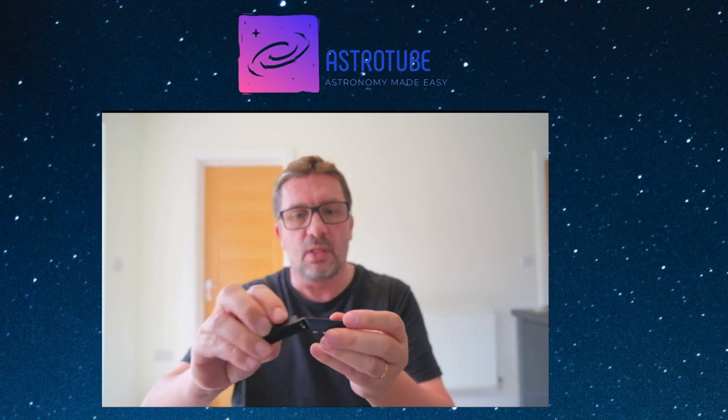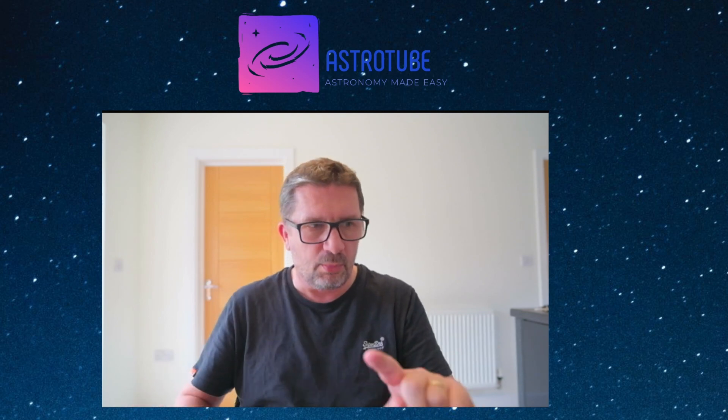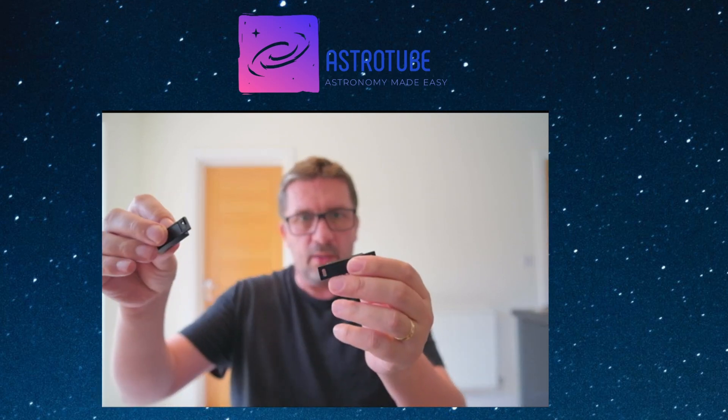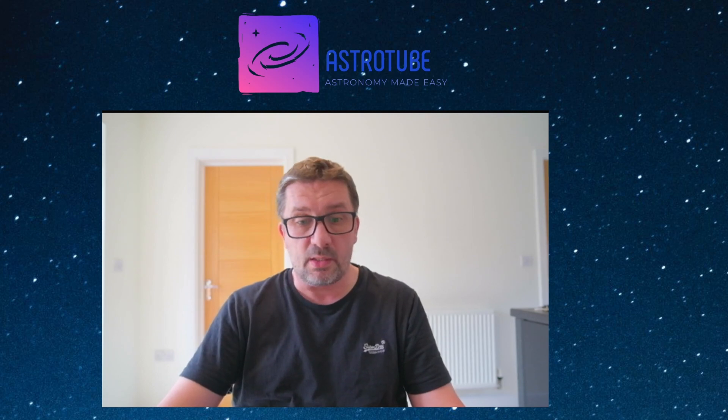The general idea is as follows. When these two magnetic components make contact or come into close proximity, it sends a digital signal to the input on your relay. I'll put a drawing on screen to explain it. That input then triggers the relay to be on or off depending on how you wire it. You wire your 12-volt power supply into one side of the relay, and the output — the relay switch — either goes on or off based on that input. So when these two come close, the signal gets sent to the relay, the relay flicks, and cuts the power to the mount. It's that simple. No external ASCOM needed — it's a hardware solution relying on no software at all. It complements the software limits on your mount to give you a physical hard stop.